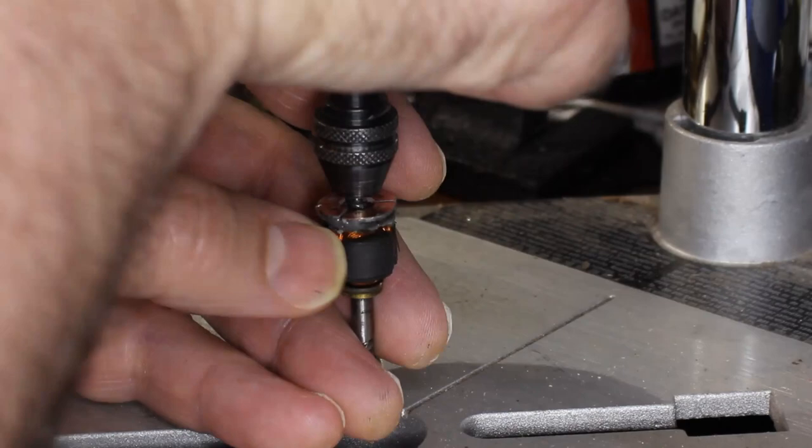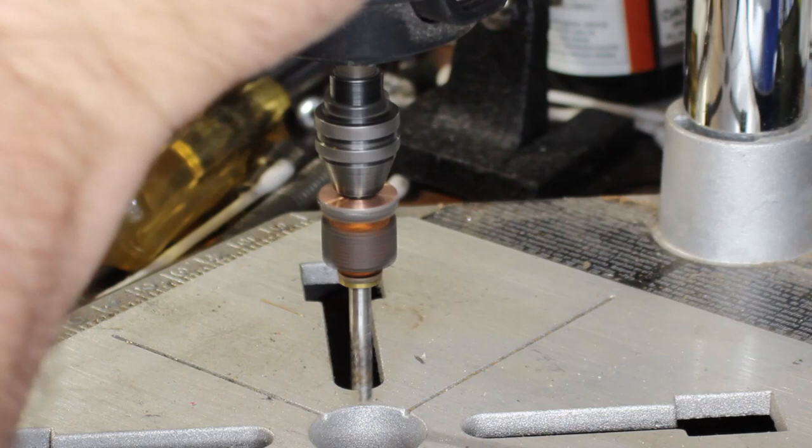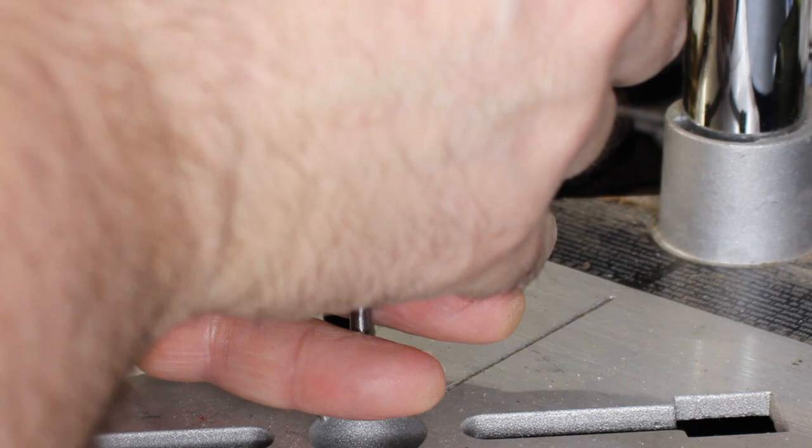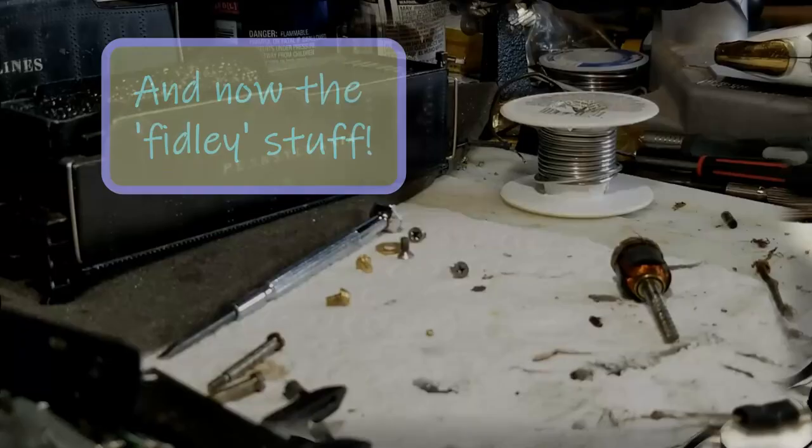You really should have some sort of a milling machine if you wanted to make it completely smooth. I just wanted to knock down some of the rough edges and even out the copper plates to some degree. The brushes have some play — they've got springs behind them. As you can see, got it nice and polished, shined up, evened out.